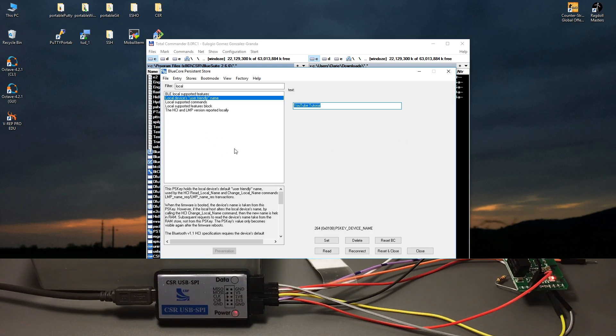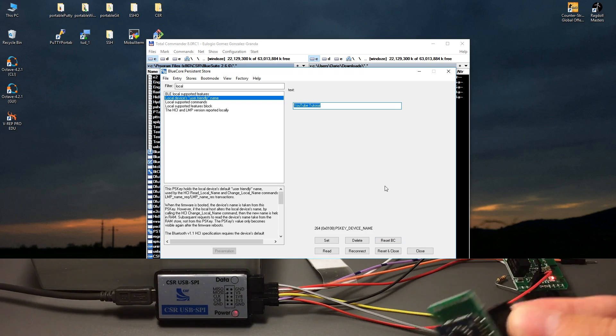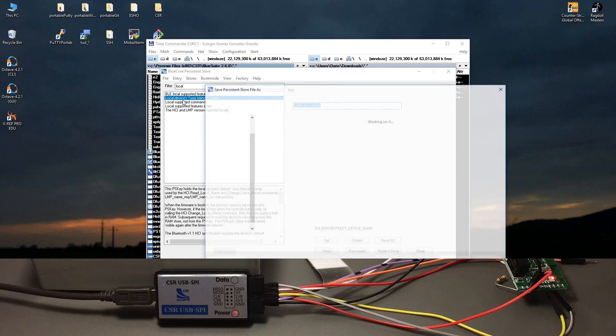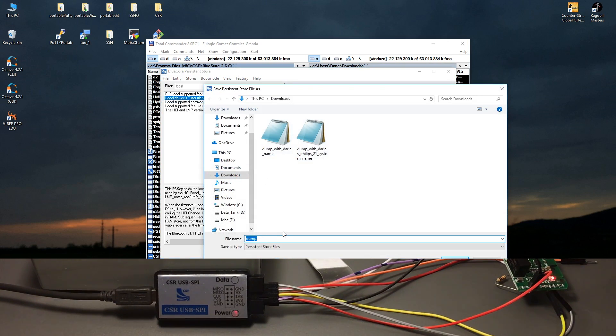There are many ways you can screw this up, and I actually did. One of the programs I mentioned earlier does screw things up, and I believe clicking 'Reset BC' also messes it up. If you do mess it up without a backup, it's pretty bad. I was fortunate to have a second board and cloned the settings from that one. I'll include the settings file in the description, but if you have a slight variation of this board it's really worthwhile to save your own. It's very fast - just click dump.